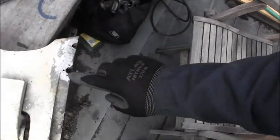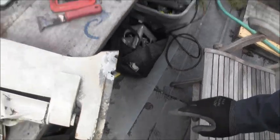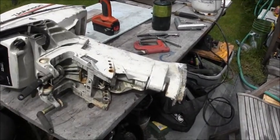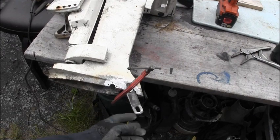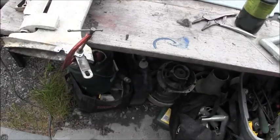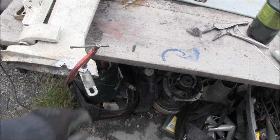So you're going to drill a few little holes like that. Something for the, I can't drill one here because of that solid piece, but that'll be enough. And you see these three holes. Let me get set up for the braze. Okay, you want to look something like that. I got a piece of flat metal that's about an eighth inch thick. And I got it on there with one of them old cheesy cheap C-clamps.